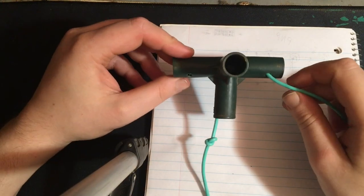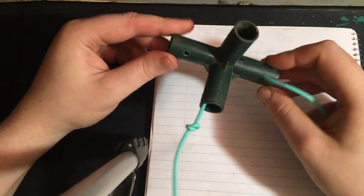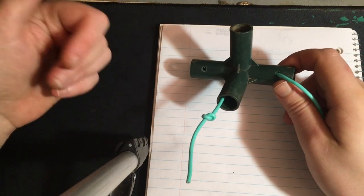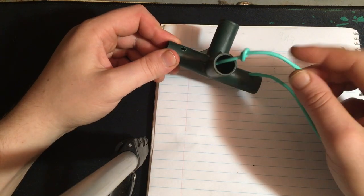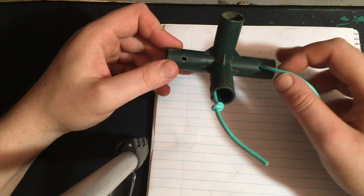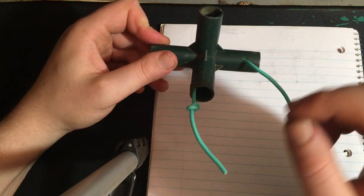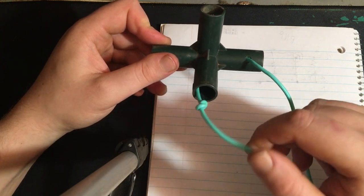Okay, so I thought I'd show you the idea first. This is a corner from a greenhouse kit. It's actually the same greenhouse kit that I used to build my first antenna, which is my first video actually on my channel. I've knotted one end. I stripped this wire. We'll calculate the length in just a second. I have a knot here. I've ran the wire through this hole here that I've drilled in there, because we don't want any tension on these wires, on any solder joints, because they'll break.